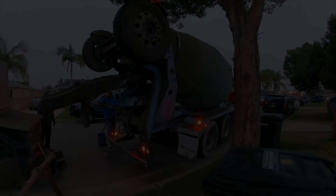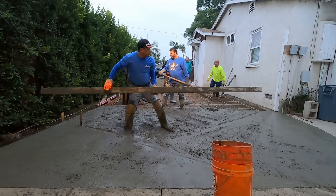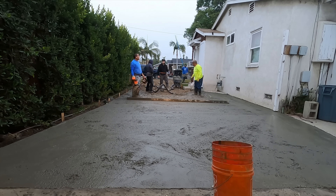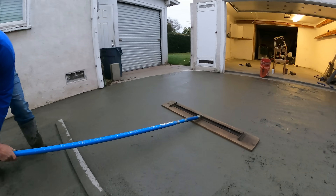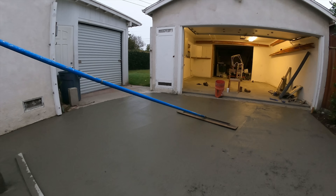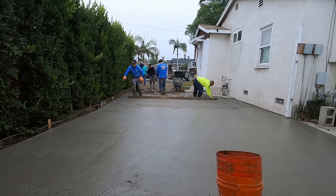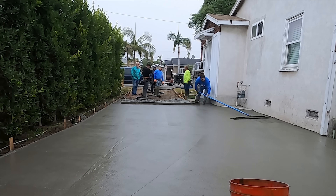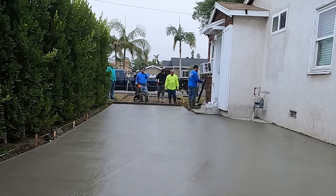This is A-Ready Mix, also known as Associated. There's a valley off this garage — I just sloped it because the existing patio is pretty low, so I had to create a drainage pattern over to that side yard. You can't do too much cross slope because we have about two inches of cross slope. From garage floor to end of pipe and street we're down to about four inches of slope. Between your cross slope and your drains above the top of flow line in the street, you don't want too much cross slope or you lose all your slope to the street — pretty tricky situation here.